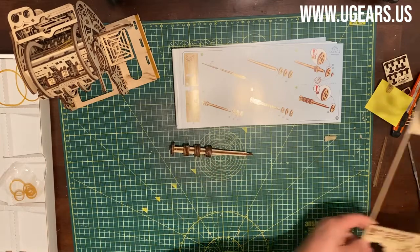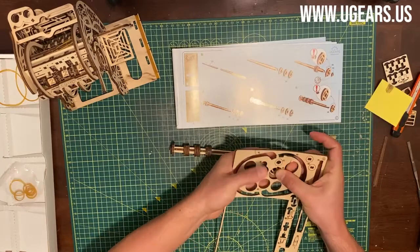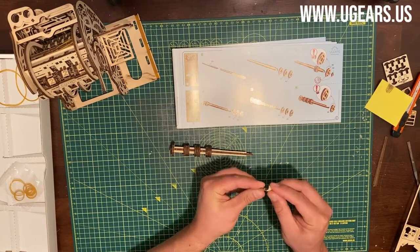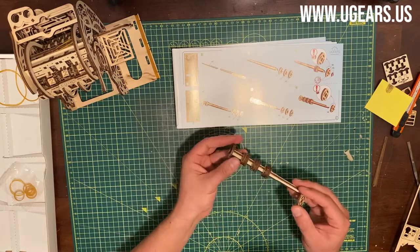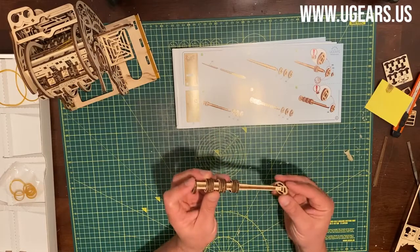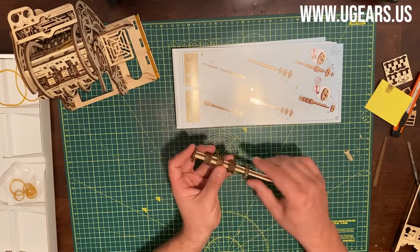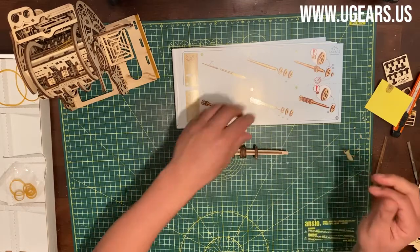And then 88, which is back on board number 4 at the top there. Now let's see, does it say to wax it? We'll wax it a little bit, as we did wax the other 88. So I'll put a little bit of wax on there, and the same thing, facing the same direction and on the same side as the one we already installed. So just look at this one and match the little tooth. In my case, it's facing away from me, and that's as far as it goes.